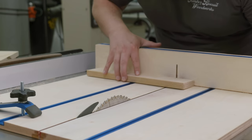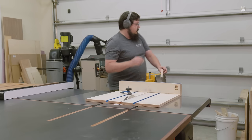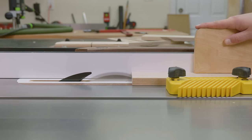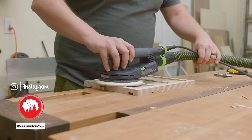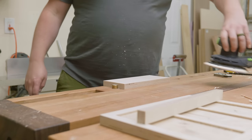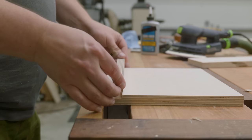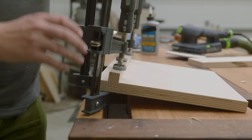From there I can head over to the table saw to cut out my piece that's going to create my clamping strip for the bottom of the plate holder. I'm ripping down that strip to one inch. Once glued up, this will leave me a strip 3/4 of an inch by 3/4 of an inch exposed, which is plenty to clamp onto. From there I can head back over to the bench and sand down my plate holder, my strip, and one extra off-cut that I'll use to create my strop — that doesn't need to be any exact dimension, I just use an off-cut from the plate holder. Then we can glue our clamping strip into our groove using some quick and thick glue to shorten the dry time.